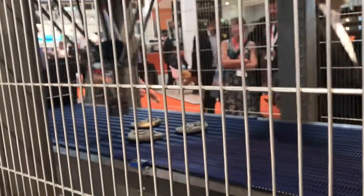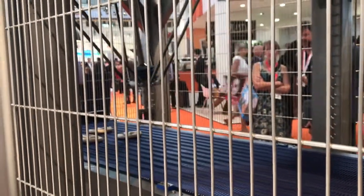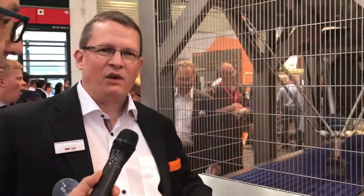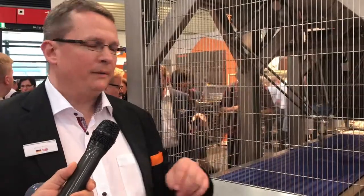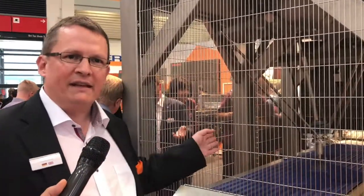Come on over here and take a look at the head — it's going to get going. That would be the action it would be taking place assuming it was doing a full run. It's in demo mode. Unique things about this scoring unit: the camera system is really detecting the surface of the dough, so the knife can follow the surface of the dough. You can do arch cuts, and you can do angled cuts with the fifth axis of the robot, so you have every kind of possibility to get every cut into the dough you want.